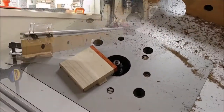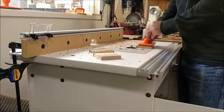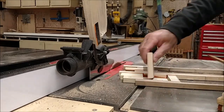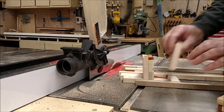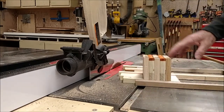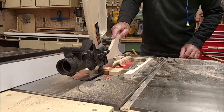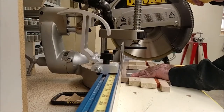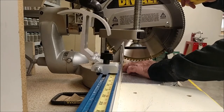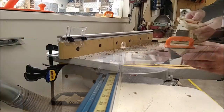I'm going to router the outside edges. You can see there's my pocket, and you can see they fit in there pretty nicely. I'm still going to sand them a little bit, but after sanding that will be a perfect fit. Now I just have to clean up that block where the pocket was — this is a straight edge — and I'll put the same round-over on all the sides.